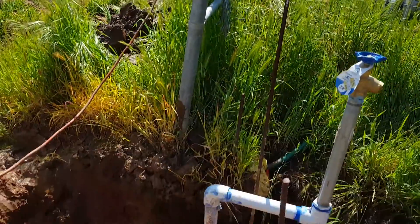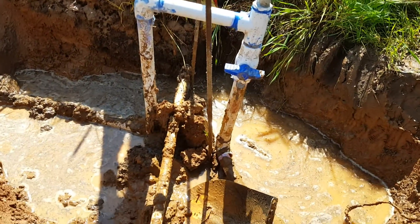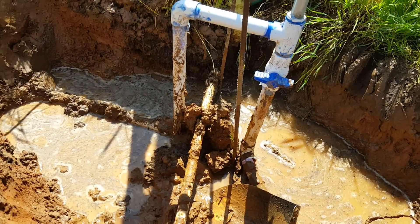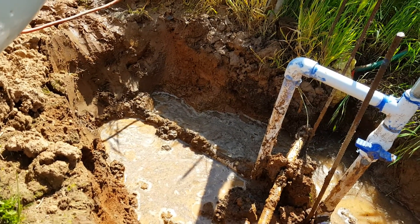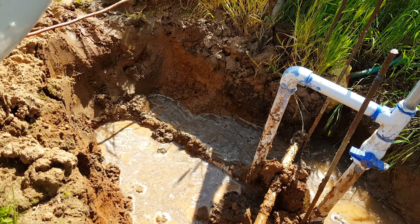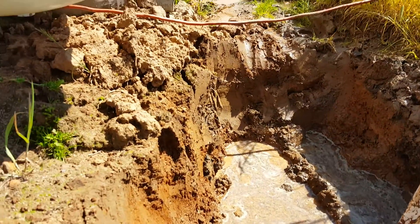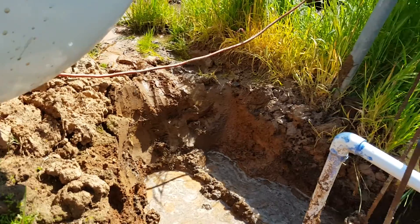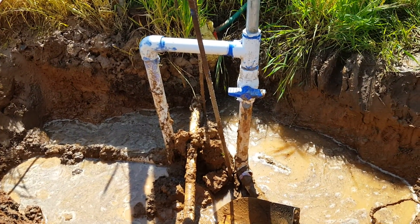Over to the manufactured home - we can do that real quick and just tie that back together. Or you can re-pipe this stuff - at any point you can re-pipe it. You want to get this ditch filled back up. Probably best idea after you get some sand in there to go ahead and put gravel in there up to grade, just to keep that soil from moving around. Right now the edge of your tank is sitting on it, so you don't want that moving. That's where we're at.